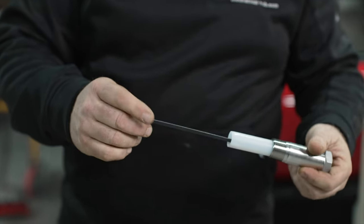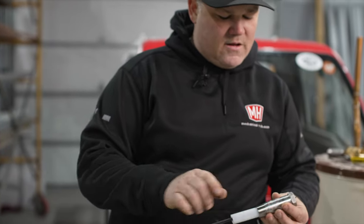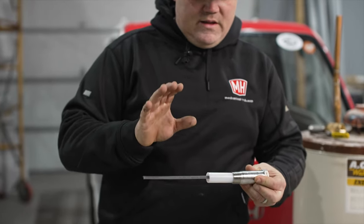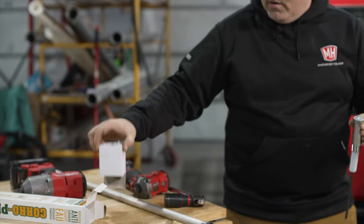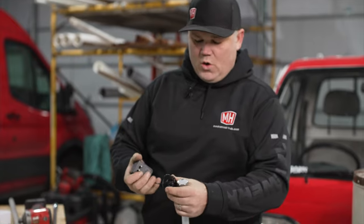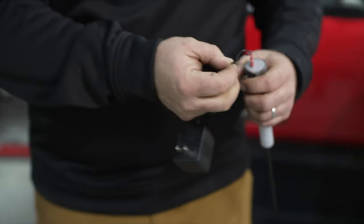These manufacturers don't tell you what that coating is, but I do know that this rod — this little L-bracket kind of metal — is titanium. This is a stainless steel fitting, three-quarter inch pipe thread, just like the magnesium rod, and it has this plastic tubing right here. That's important in shielding the current from these two metals. This is the entire rod, and there's a little 24-volt, 50-milliamp transformer, and that just plugs into the top of it. Very basic — there's just two plugs, a spade connection, and then there's a grounding wire that you want to attach to the top of the tank.